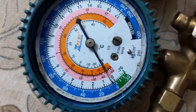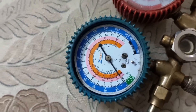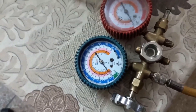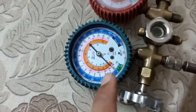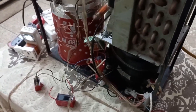Now the running pressure is 4 psi, which looks very less and suggests I need to increase the gas. But I will say again that at this place the ambient temperature is less — that's why 3 to 4 psi pressure is okay. When I install this system on my aquarium next month, when ambient temperature will be 35 degrees, the running pressure must be less than 8 psi. If I increase the gas and the running pressure increases to 10 psi, then there is a chance the compressor can trip.